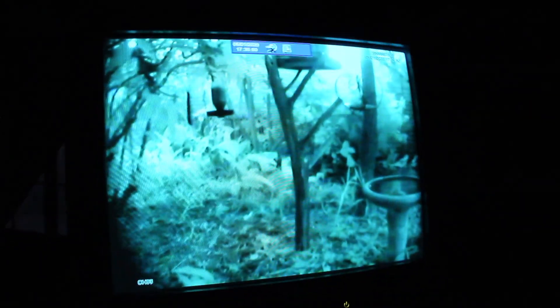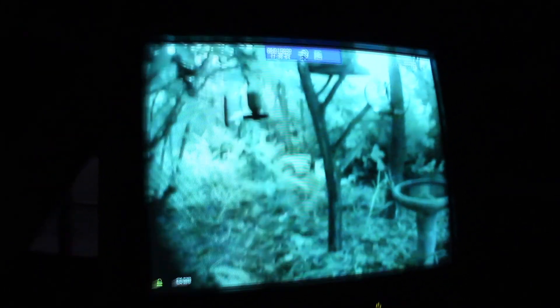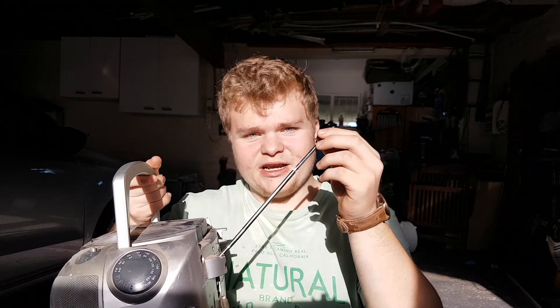There is a signal — not that great of one, but there is a signal. So far I've tried using a simple radio antenna to extend the range of the camera and found it wasn't that great, simply because the amount of energy the camera puts out now has to be spread across an antenna about this long, and it's not well optimized for that.